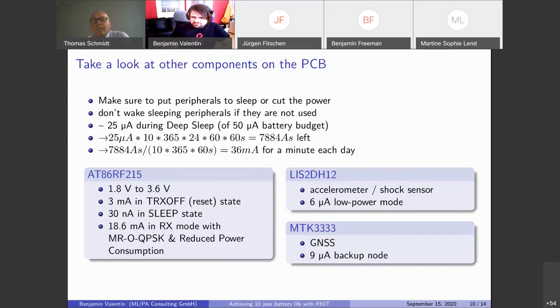But is it also 6LoWPAN? Yeah. Okay. It has some pitfalls there. It needs neighbor discovery currently. That's not nice, but it works for us currently. Interesting. We had noticed that problem. So do they have multiple border routers, or are they all the same address?